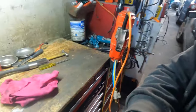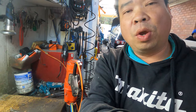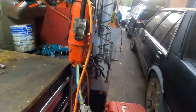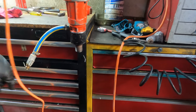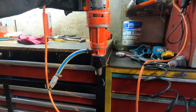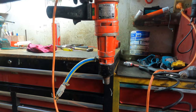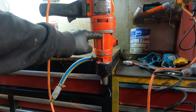Okay guys, thanks for watching Simon Tools. This is how you basically service the Weka core hole drills in the normal service. When they come in, you must clean all of this. All the dust, water, sand that got in here, you name it. But that's not the main key. The main key is here, the gear is split, that's why they bring it to you.